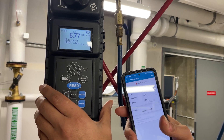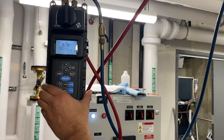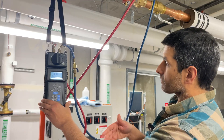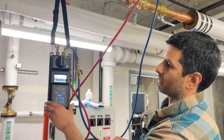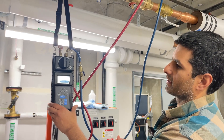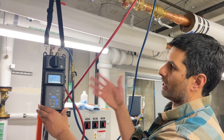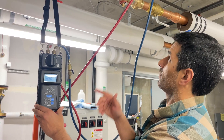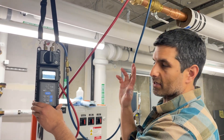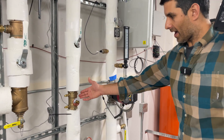You can see the dynamics of the flow updating and changing, and you can log this value into internal memory if you want to trend it for a while — you can get the flow without constantly using the app to update your measurement. Right now it's sitting pretty static; depending on how much hot water is being used and the temperatures it'll change, but this is about exactly where we wanted this flow to be, so we'll call this commissioned.